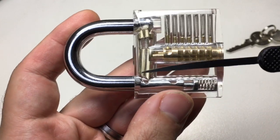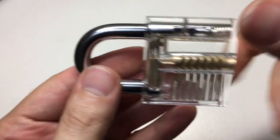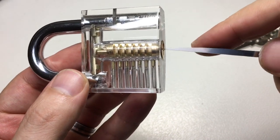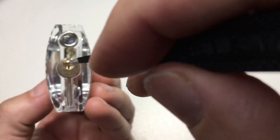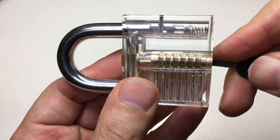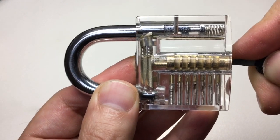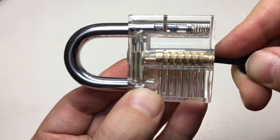Now, in a lot of very old locks, you used to have only one locking pawl, usually on this side of the shackle. And therefore, it was quite easy, if it was unshielded, to go in with the knife along the top of the pins, angle it down and catch the part of the locking pawl which the actuator at the back of the plug would enact on.